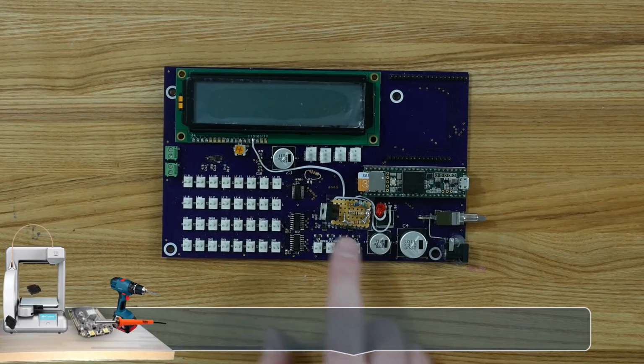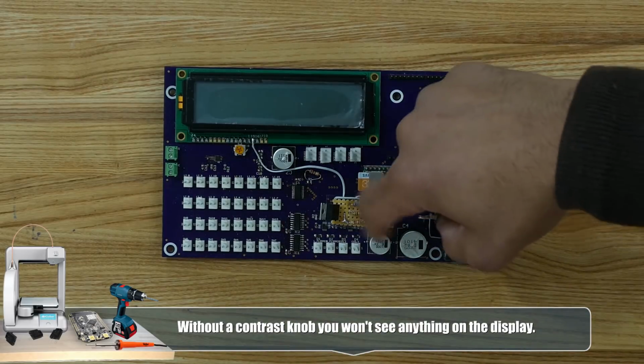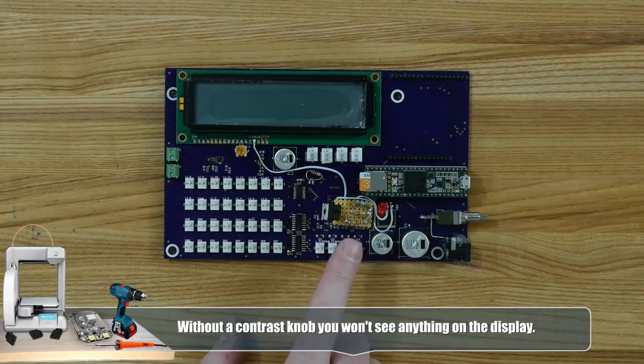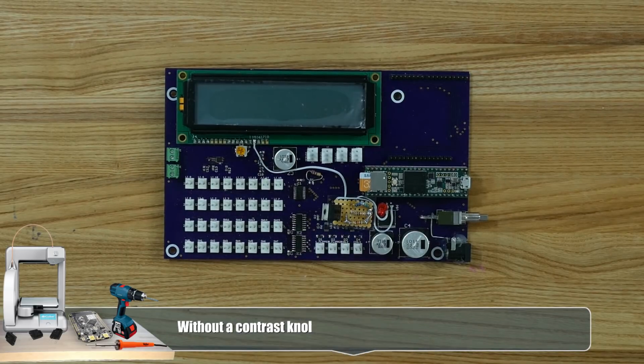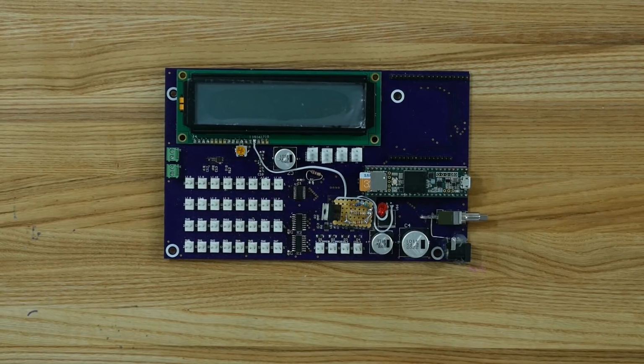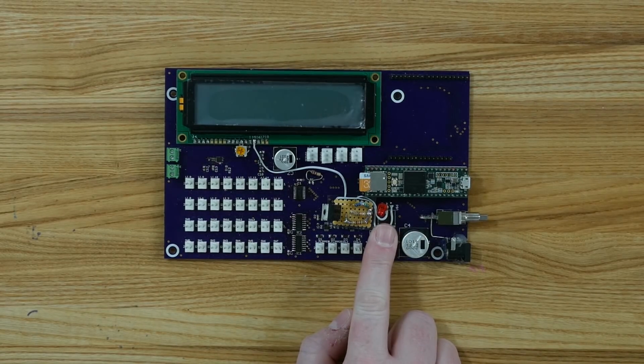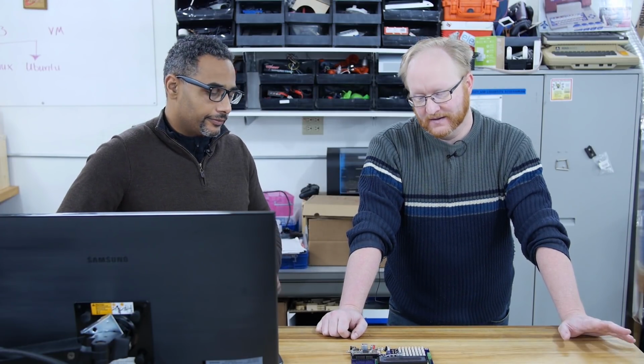All right, what is this? Okay, so this is my little rig to get the 6.5 volts to turn on the LCD. So you're using a variable power regulator? Yep. I set that up to 6.5. It's an LM317, I believe. Okay. And then you talked about the 5-volt regulator getting pretty warm? Yeah, I noticed that it was really hot. We're taking 12 volts and knocking that down to 5, and we don't have a lot of... It's a linear regulator, isn't it?